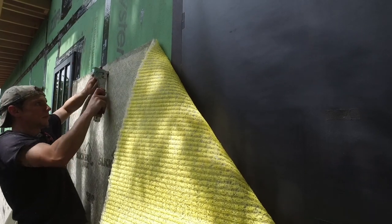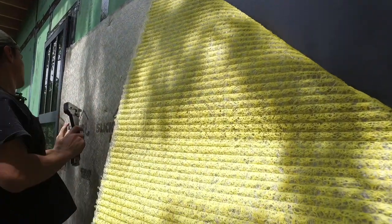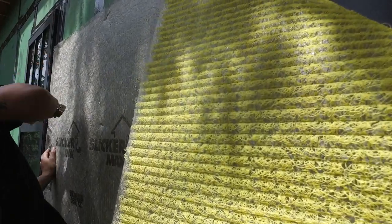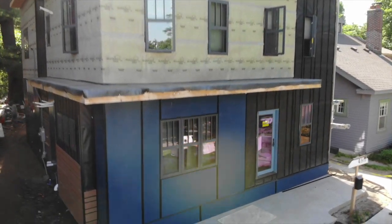Slicker Max is an entangled matrix drainage mat made from polypropylene. It offers excellent drainage and compression resistance, and is being used wherever the three-quarter inch PVC Paint Pro panels from Azek will be installed.